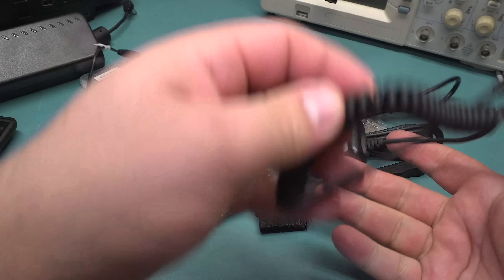There's also a phone charger included in this thing. The unit will charge phones on its own, but they probably just want it so you can charge up a phone while you're doing something else. So this is a very small USB battery bank — it's not particularly powerful, it's a one amp output. It's only 8 watt hours and it's pretty tiny. It has a little battery check gauge. Opening it up, inside it's exactly what you'd expect — just a simple battery charging circuit and a USB output. It's pretty old just based on the amount of stuff on it, with a bunch of larger components and discrete chips. Looks like they've put the protection circuitry on this board with a little fuse and thermal cutout.